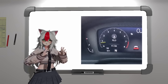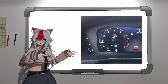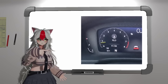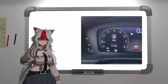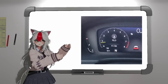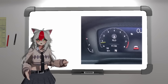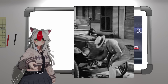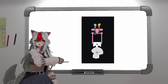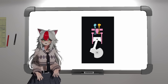And this is the reason why, if you notice on your dashboard and you look at your tachometer — that's the one that measures your engine speed, or how many rotations per minute your engine does — your tachometer is always at like 600 to 900 RPMs, because the engine needs this momentum to keep itself running. Once you stop it, like you stop the piston from moving, it can't continue the cycle. That's why when you start an engine, you have to engage the starter — that's an electric motor that starts this whole process. It spins the engine until the engine can do its power stroke and sustain itself without the starter anymore.